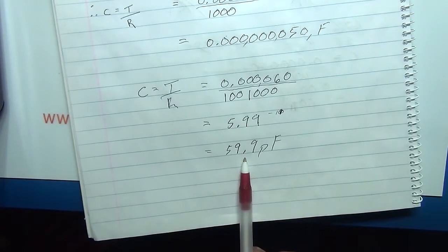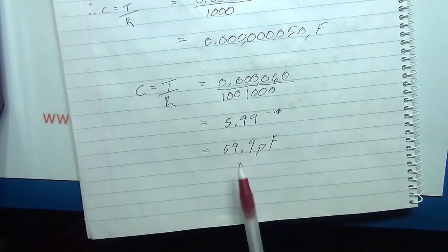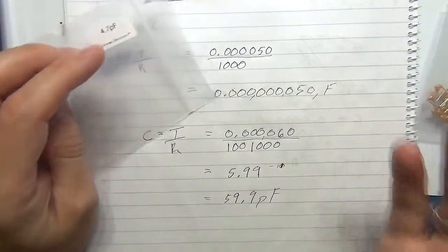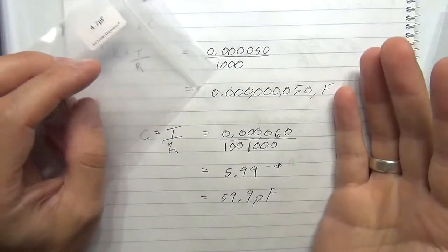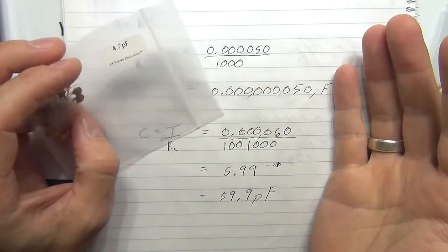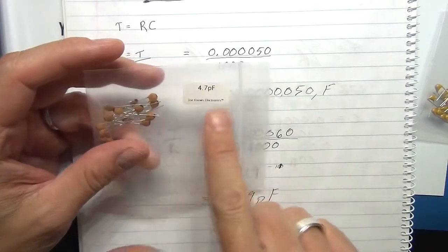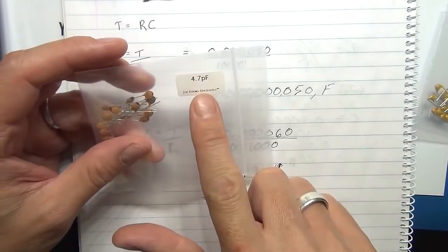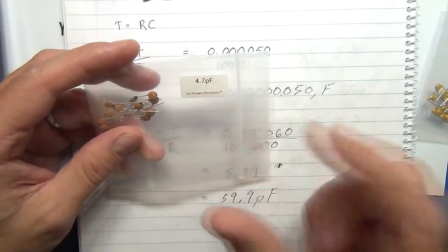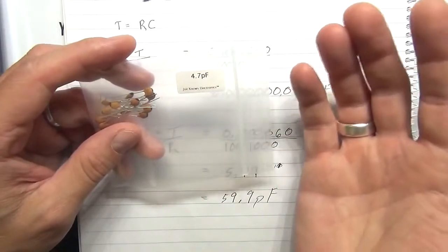So I'm going to go away quickly and fiddle and change frequency and mess around and see if I can resolve this, because I cannot see from here where I've gone wrong. Right, so for the life of me, I cannot figure out where I've gone wrong. It's probably something really simple, and I'm looking at this and I'm not finding it. I think there's perhaps a couple of issues coming into play here. Once you're going down to this level of small capacitance and setting up on the scope, I think perhaps I'm entering a level where it's very difficult to measure because of the range you're working at and the potential noise, I'm guessing here, open for debate.